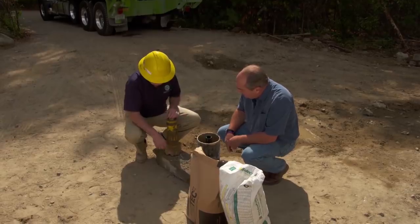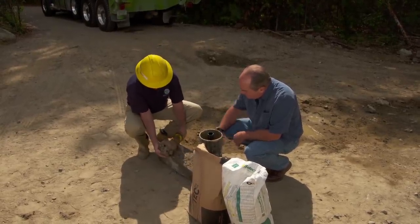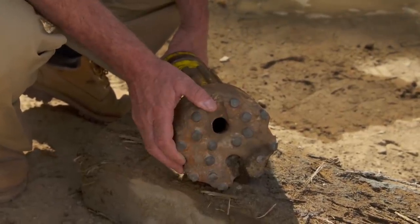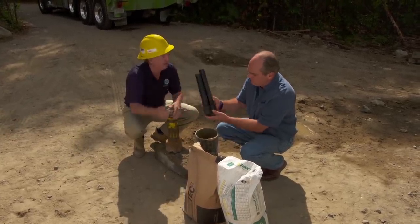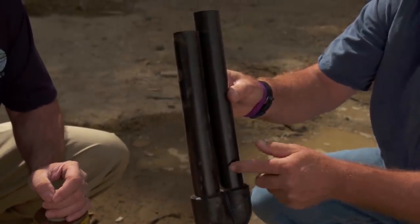And this is our drill bit? This is the drill bit. We end up drilling a six-inch borehole. They're made of tungsten carbide, and that'll just keep going down three, four hundred feet. And then after we're done with that, we come back out of the hole and insert this U-bend piping with a U-bend on the bottom. This is a polyethylene pipe that's going to be filled with antifreeze, and that drops all the way down that shaft.